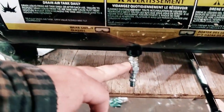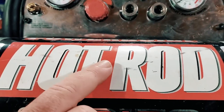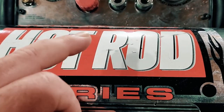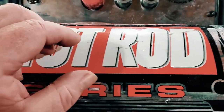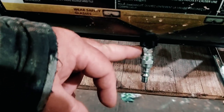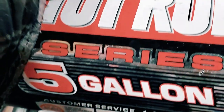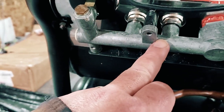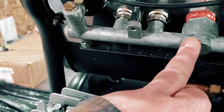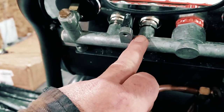You might be asking: why can't I just plug in here, since there are two couplers here? Some compressors do come with a tank pressure coupler, and if yours has one you can plug right into that — that's the simplest solution and you won't have to remove your drain cock. The reason you can't use the standard output couplers is that those two couplers are side by side and they are after the regulator, so if you put air in there you won't be able to regulate it.